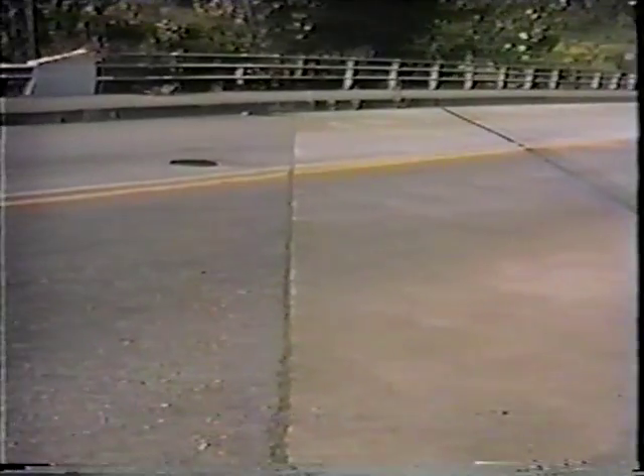Here's a classic example of an area where a small cold planer would fit in — maybe a three-foot wide cut outside of that old underlying concrete pavement. Here where we have this edge cracking, that's an area where the water can get in. And since this is a narrow old underlying concrete pavement, the trucks' heavy loads actually run off of that concrete and start breaking down that shoulder area.